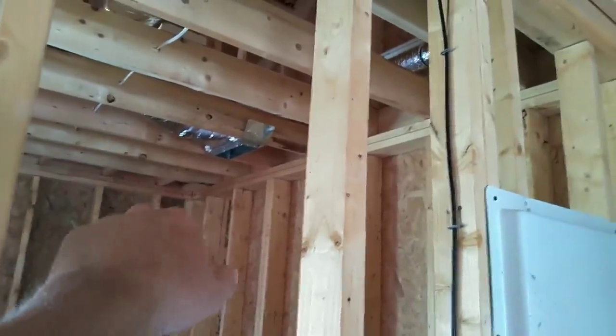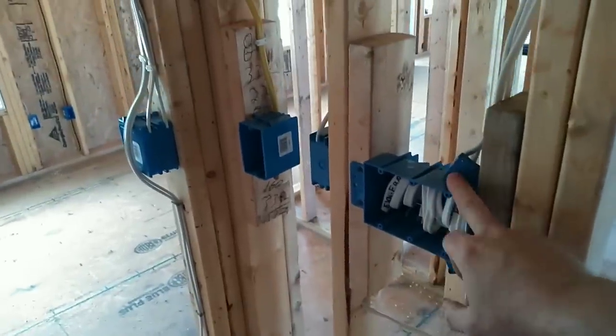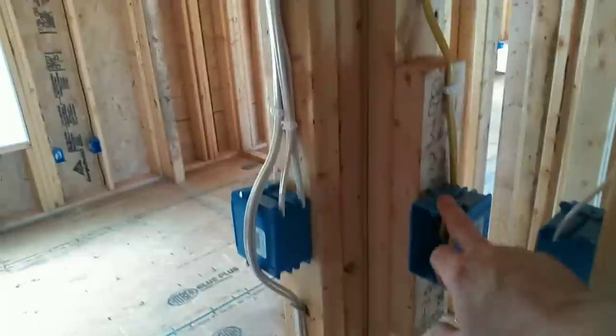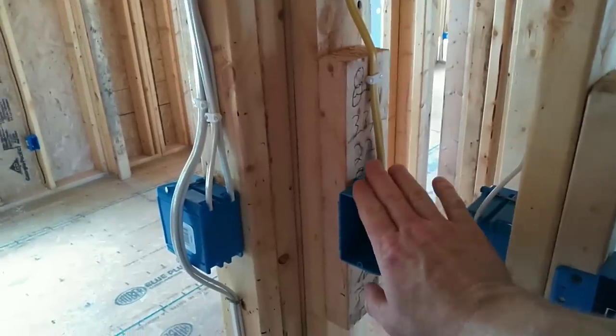The exhaust goes up and you can see the flex — it goes to the back soffit area of the house. Coming in on the way I wired this three-gang box: got a 14-3 coming in, a 14-2 is the vanity light which is right there, this is the light on the fan, this is the exhaust fan, and then we have an outlet to serve this bathroom.